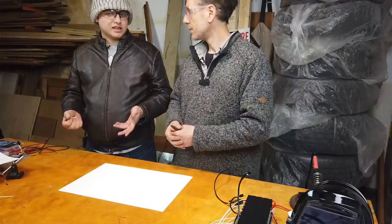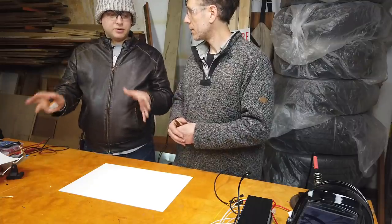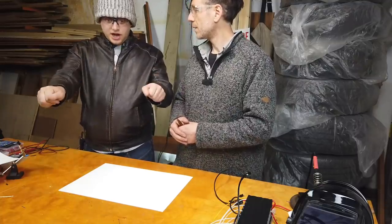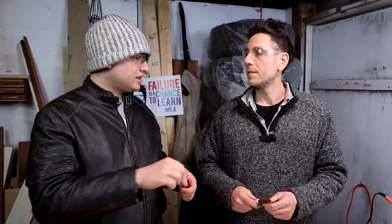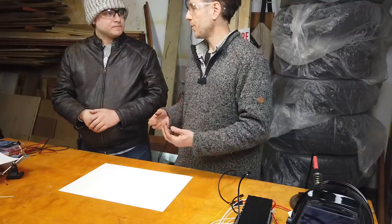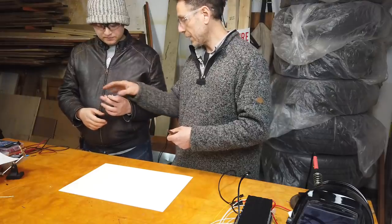Okay. So if we were to use just a light switch, say, the amps would work and the voltage would work. Yeah, so that would work. But the problem would be I could turn it on, walk away from it. Right. And then who knows what would happen. Exactly. And if I were to shut it off, the blade would remain spinning with all of its inertia. So it's just going to keep going. Yes. It'll slow down eventually, but probably not fast enough if there's something bad that's happening. Almost like a chop saw. We want it to stop when we let go. Okay. So how do we do that? So you have what's called a momentary switch.